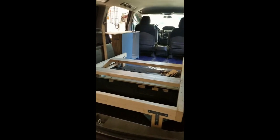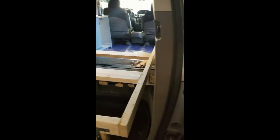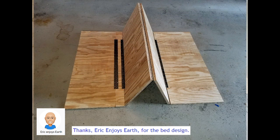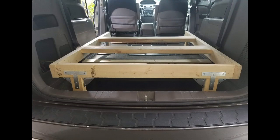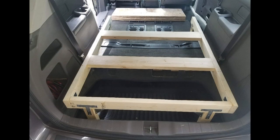Here's what it looks like as a skeleton. The first thing I did was I built this platform, mainly because it was the easiest thing to do and I needed a quick victory. So with the platform in place, I was ready to build the frame that it goes on. The reason I wanted to do the platform first was because I wanted to have all the measurements of how it was going to fold up and how much room I needed for the seat, and how it was all going to work together. Then I needed to know where those hinge points were going to land, because that determined where I put these crossbars on the bed frame.